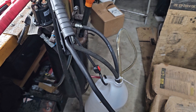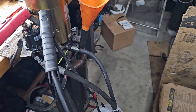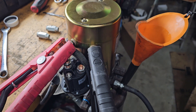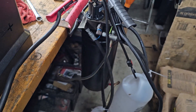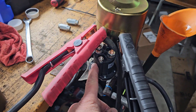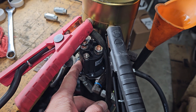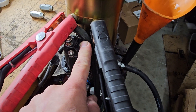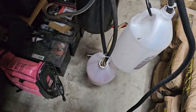We're going to jump it just to prime it. You want to make sure you have the polarity right, because otherwise the pump will be spinning backwards. This is what I call flushing it, especially after disassembly — I took it all apart, as you remember from my other videos. I think this is like video five or something. I hook it up to a battery pack, positive, negative. I even put an improved amperage contact relay in there. I know y'all are going to call that a solenoid, but a relay takes a small amount of amperage — that's why it's got the small terminals — and controls a bigger amperage. We're going to turn it on; this line and this line right here will fill that bucket up and we're just going to prime it.